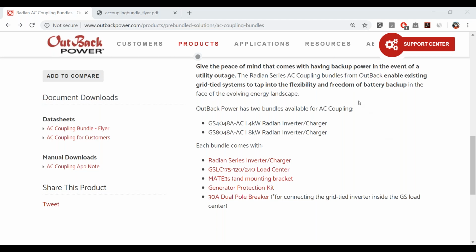Last question here, the most recent question, since we are out of time, so this will probably be the last question. Is the 30 amp the max grid tied inverter output? No, it's not, but it's the most probable because on a 6 kilowatt inverter, a 30 amp is the correct OCPD.